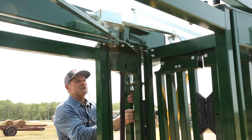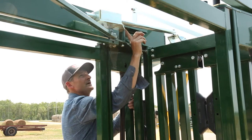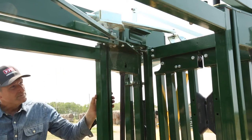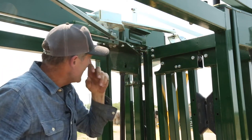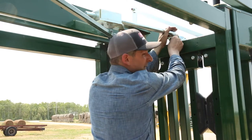like that, because you need to have lots of play in there, because underneath this fandangle there's a bolt that has to come out. So we've got this completely backed off. Now we come over here, we got a 1/2 by 4.5 inch bolt and a 1/2 by 2.5 inch bolt. So remove this bolt here, loosen it to make things easy.